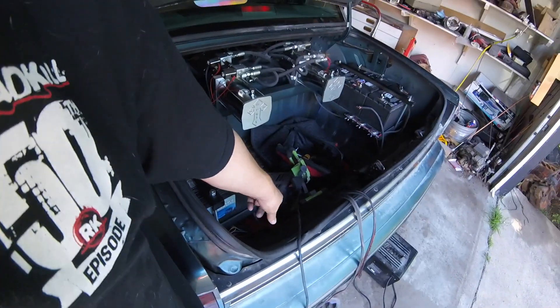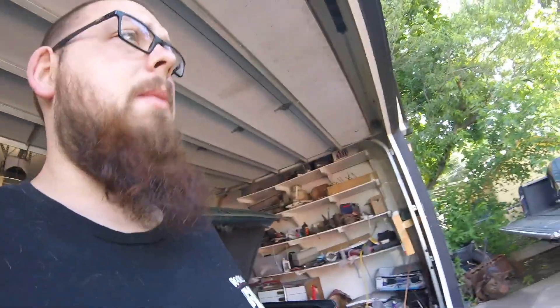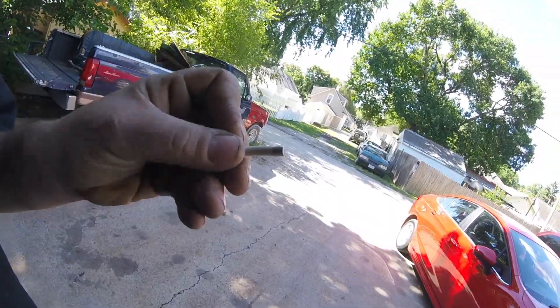I tested just another single battery charger that I have and it has current. Then I resistance-tested the fuse to make sure it's bad, because for some reason they put a white fuse in there. I've heard that they're ceramic fuses — better quality, blah blah blah. Obviously they're not great quality because they're blowing.